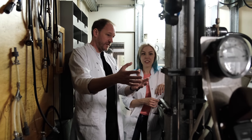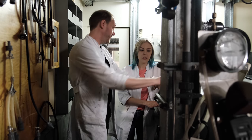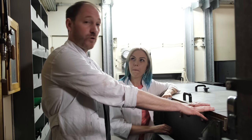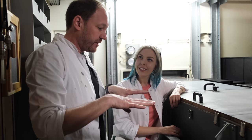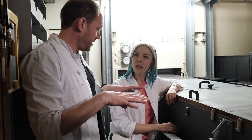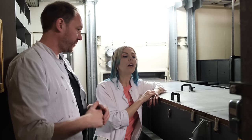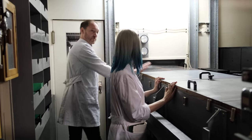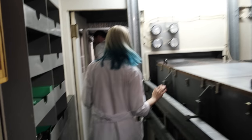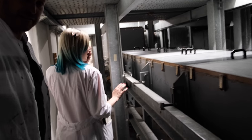As soon as you did the magic, your film vanishes and it's gone. Well, it's not really gone, it's in these boxes. We blow cold and dry air on the film, so the surface hardens a little bit, it gets a little bit stiff, and it's not flowing anymore, it's not coming off the film anymore. So, here comes the film at 30 meters a second. It shoots through the cold and dry air. Oh, mamma mia!